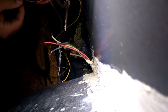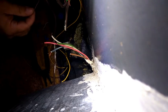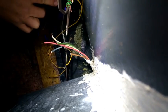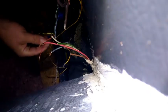This brown wire here is emergency heat but it dead-heads inside, so we don't need it. We're going to need a red and hopefully we can get these out of the wall downstairs — yellow and orange — and we may or may not need a brown; we'll probably just jump those together.